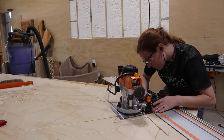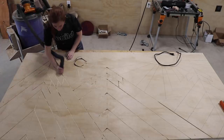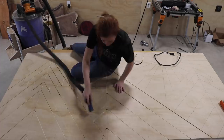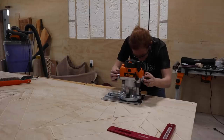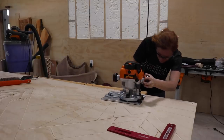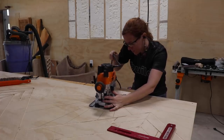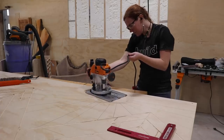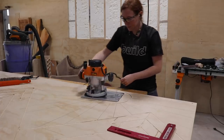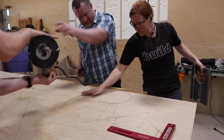As for depth, I cut down about three-eighths of an inch. After getting the second mountain completely cut out I stopped to vacuum out, and I was so excited that this was actually working out. For the sun, I swapped out the router adapter for the edge guide that comes with the router, which you can use not only as a regular edge guide but also as a circle-cutting jig. I found center, stuck a brad nail in as a pinpoint, and made my circle cut — quick and easy.